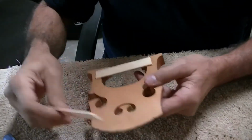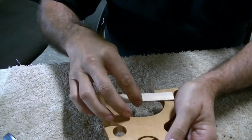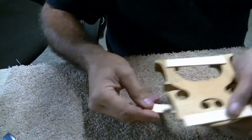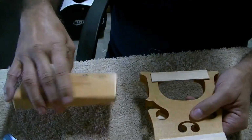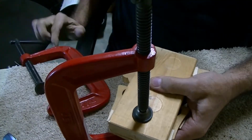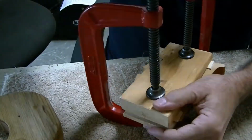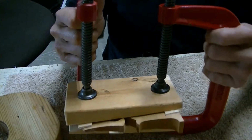We'll find out. I let the bridge sit for 24 hours and dry, and it's got most of the curve out of it. But I wet it back down, and I'm going to try adding just a little bit more bend to it for another so many hours. What I'm going to do is use these little thin strips of wood to put a little bit more pressure to straighten it out just a little bit more. Yeah, that looks good. I'm going to let her sit like that for a few hours till it dries out again. I think we'll be fine.